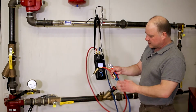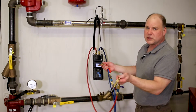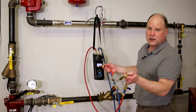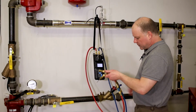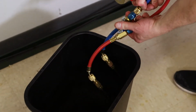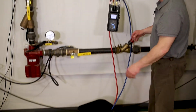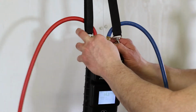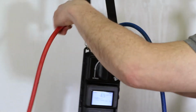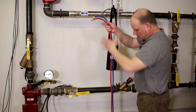When we put the valves in the off position, there's a slight vacuum holding the water in here, so we shouldn't see any air inadvertently get into the hose lines. When we're done for the day, just open up the shut-off valves on the low end on the short hoses in a suitable receptacle. Disconnect the hoses from the meter. And let them drain.